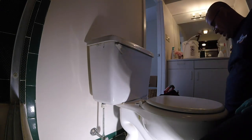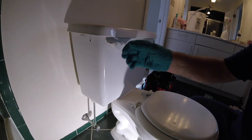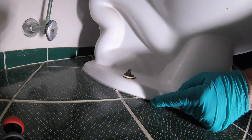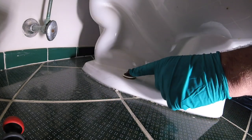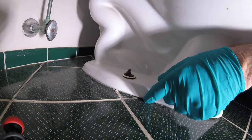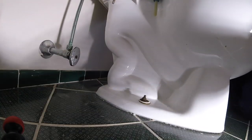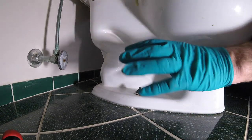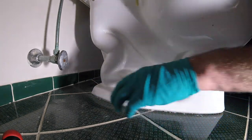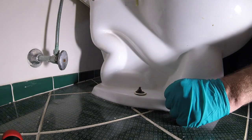When you flush the toilet and water leaks at the base — your bowl wax, loose bolts, bad bolts, a bad bowl wax which we're about to pull up in a couple seconds — and the worst of all, a broken toilet flange. A broken toilet flange causes the toilet to rock back and forth and won't get a proper seal against the floor. Also, a bad, unleveled floor can create a leak because you can't get the toilet to sit flat, and it's all top-heavy when you flush.